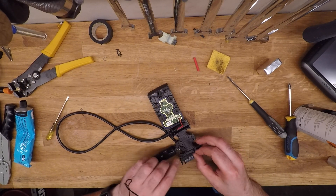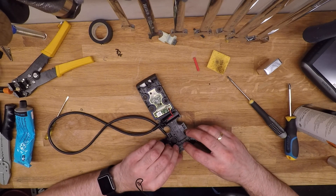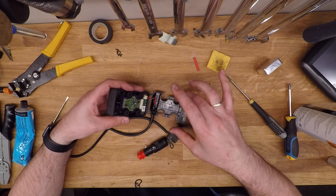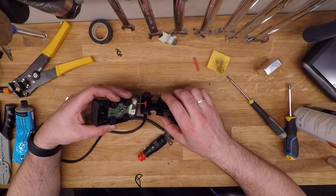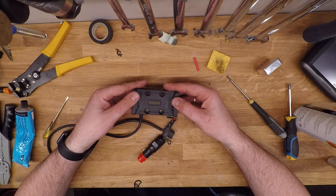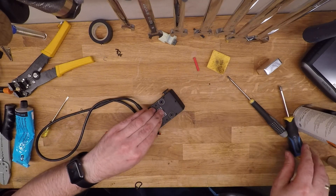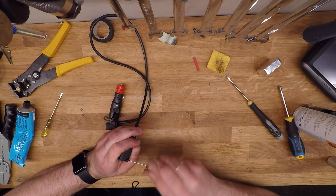Get the spring and the disconnecting latch and get that inserted into the rear part of the mount. Right now the gasket is still wet, but as long as I leave it in this orientation it will dry up fine without hitting the circuit board. Clipping that back together is just a matter of reinserting the 7 Torx screws on the back, and once you get the last one in you're all done.